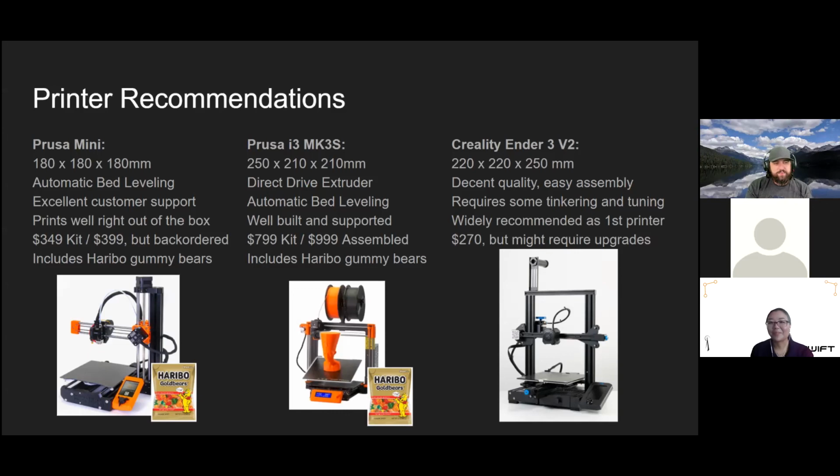There's another question asking about the fumes of the 3D printer. There are a couple of schools of thought on this. One is that things like ABS and ASA have strong offensive odors and are technically carcinogenic plastics, so don't ever print those in a habitable space because they're noxious and they'll give you cancer. Some people extend that to say don't print any material in a habitable space, like PLA. Personally, I do very limited printing with ASA or PETG occasionally. But PLA I'll print all day, every day in my office, with my printer right here behind me, and it doesn't bother me.